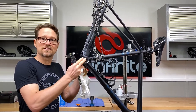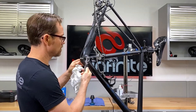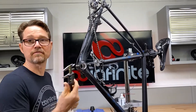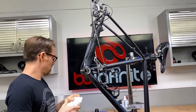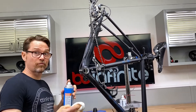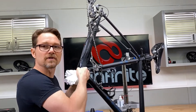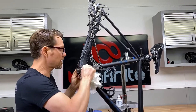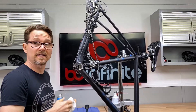The first thing you need to do is measure it. This is the typical way people try to measure it, but you are never going to get a good measurement with a Vernier caliper — it's just never going to happen. What you need to do first and foremost is clean it, because if it's dirty, one of the things you're measuring is the dirt, and the kind of measuring we're going to do here is sensitive enough that that will make a difference.